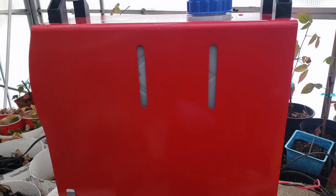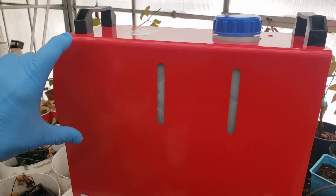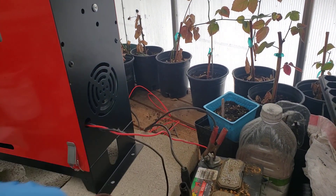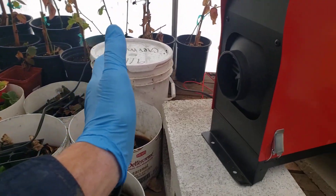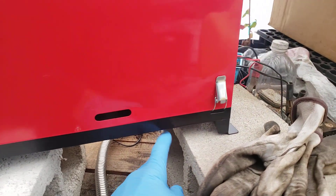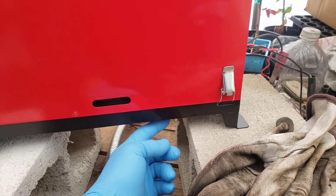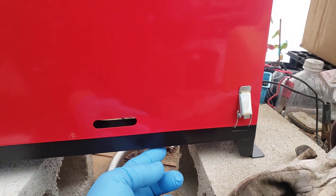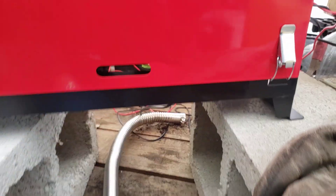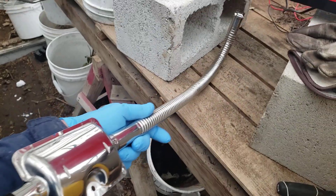The little fill tank holds over a gallon — maybe three to five liters. The diesel tank is on top under the little metal piece, and the burner section is underneath. It sucks ambient air through the back and blows it out the front — hot enough that I can't keep my hand there. The oil pump feeds from the tank up next to the combustion pipe; the pipe on the right receives combustion air and the pipe on the left is the exhaust, which gets really hot.